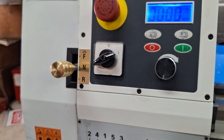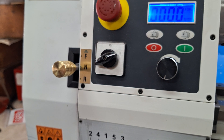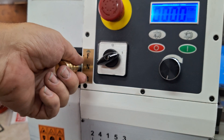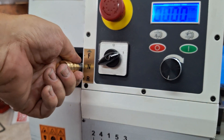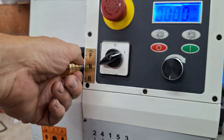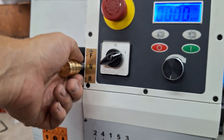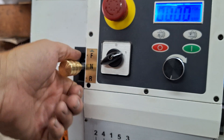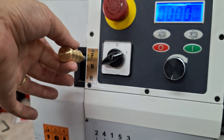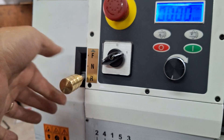Hi folks, St. Paul's Steam in Machine here with an improvement I've made to my lathe. I've watched several videos of people making reversing levers with a detent, and I thought I want something a little smoother than that — where I'm not overcoming the force of that detent spring and possibly throwing it to forward or reverse by accident by overshooting. So I wanted something that glided a little easier, and this does that.